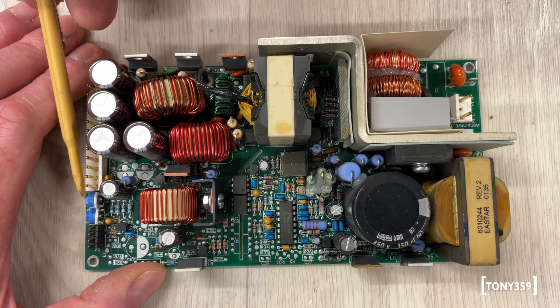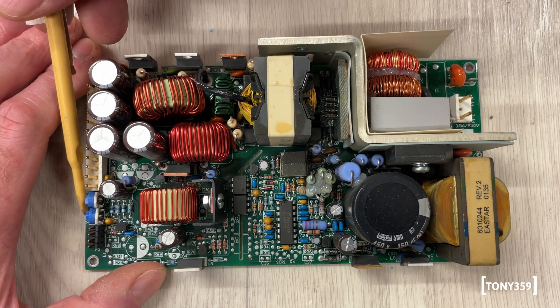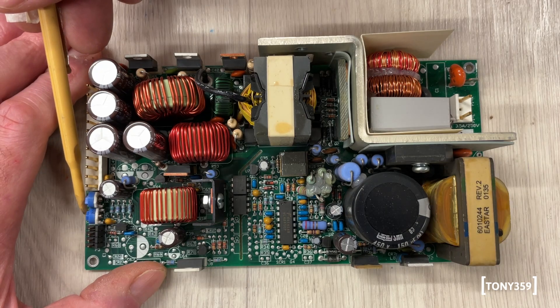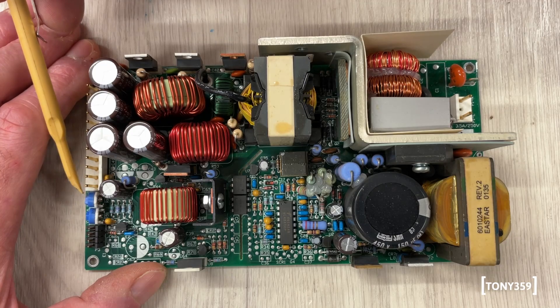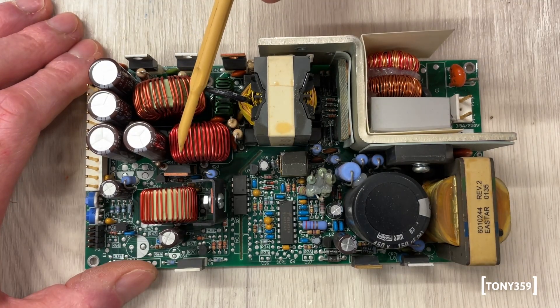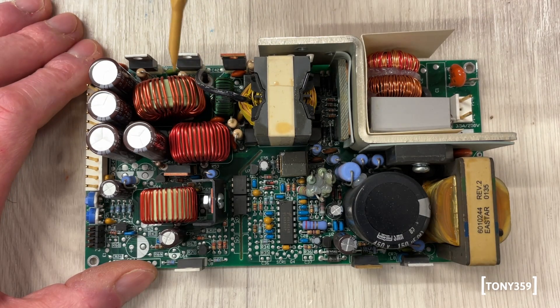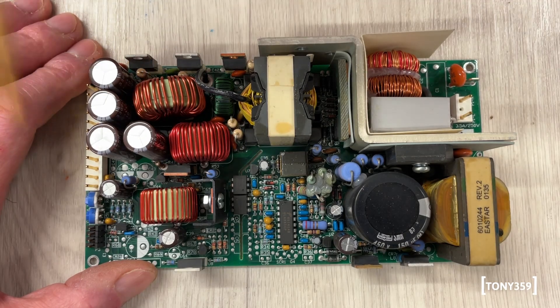There are two adjustments here — it says V1 adjust and V2 adjust. From the label, V1 is plus 5 and V2 is plus 15, so the minus 15 is probably linked to either the 5 or the plus 15. I would say there are two primary voltages and one which is derived is probably less important than the others. Finally we have inductors, capacitors, and then our output. It's a reasonably easy power supply.